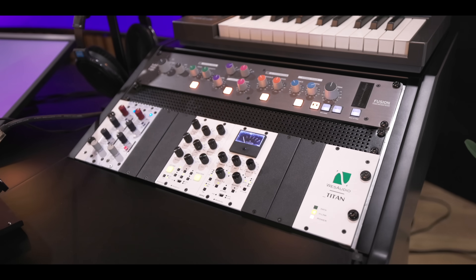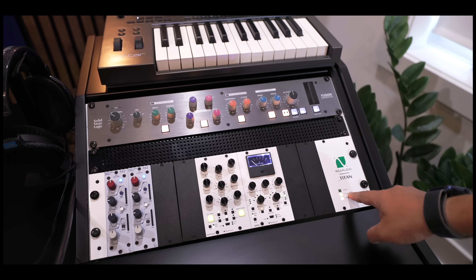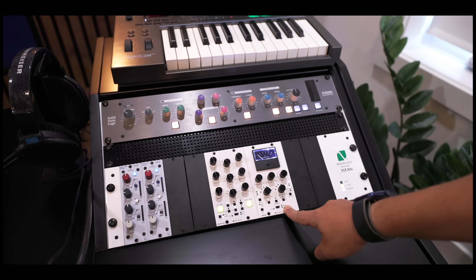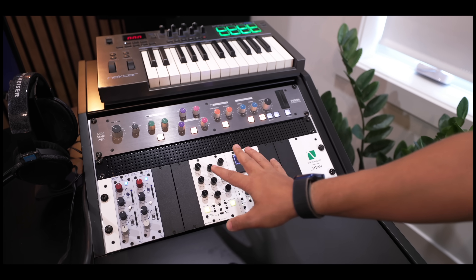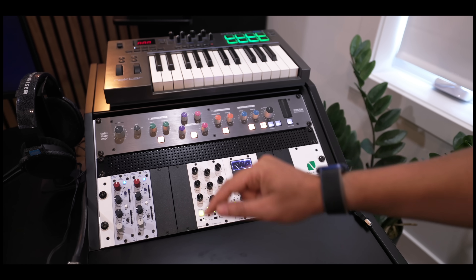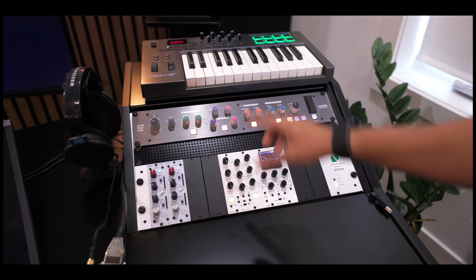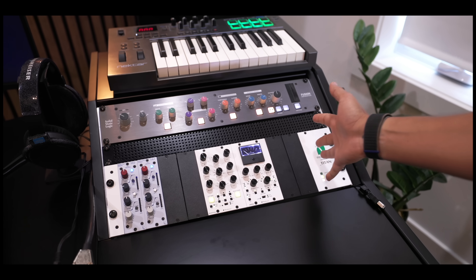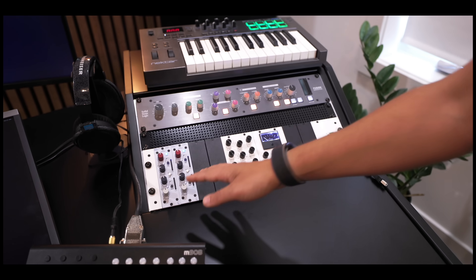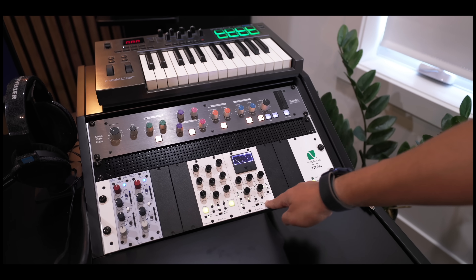I'm using the Wes Audio Titan. I've been using some of their stuff and they're incredible. This is their Pultec EQ version and this is their version of the SSL G bus compressor. What I love about Wes Audio is that they hook up via USB to your computer and have a plugin — you change the settings in the plugin and it actually syncs to the hardware. It's a digitally controlled analog unit. When you open a session and the plugin is in the session, it recalls the settings from whatever you had in that session. But it's fully analog because you pass audio in and out through it. Using their chassis, you just use one USB on the back and it automatically recognizes all 10 channels.